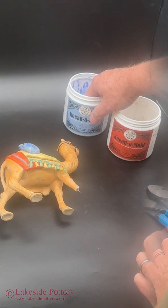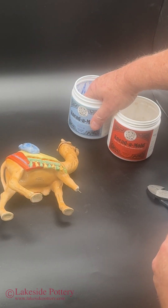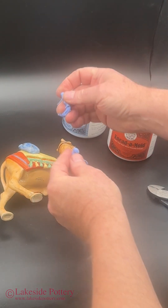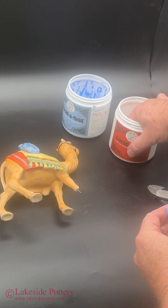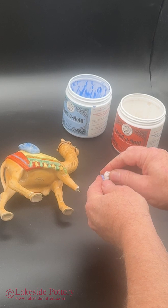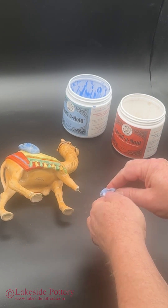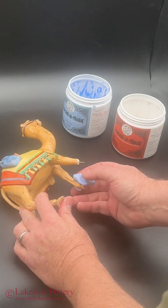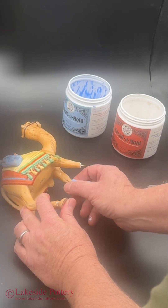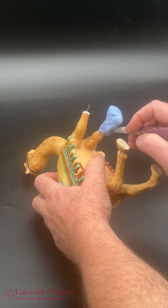The left foot is in good order. I would take an impression of that even though it's not in the same angle the way the step is shown — I would adjust that later and I'll show you how this adjustment is done. The next step is to take this two-part silicone rubber and take an impression of the good foot, let it cure, and then cast it in resin epoxy to create the foot.